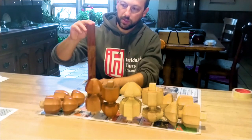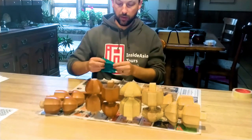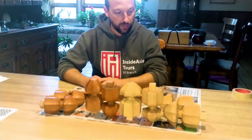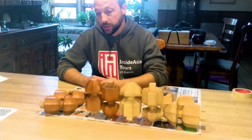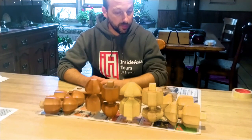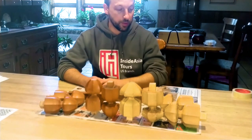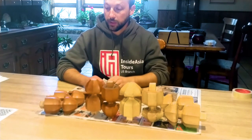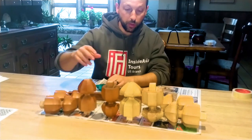But yeah, you can really see the difference. You've got the linseed oil penetrating the wood, creating that resin inside. You've got the wax on the surface, and that's going to protect from debris, slight scratches, as well as keeping the mold off of the surface of the wood. And the processed linseed oil, making sure that the oil itself is not going to be food for any kind of mold, where raw linseed oil might be, and other vegetable oils certainly will be.